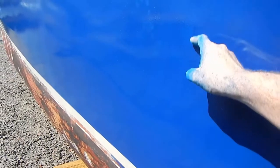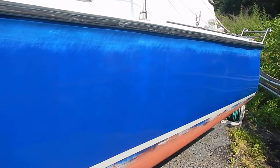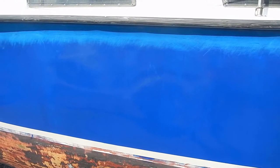But a couple other reasons — I'll show you why I have to sand this whole thing down probably every time between coats. One reason is roller marks. Some of this is probably correctable by better technique when rolling the paint, but I think it's kind of unavoidable at the end of the day when you're not spraying a boat and you're just rolling the paint on with a foam roller. I need to sand that out so we don't end up with any pronounced ridges in the final paint job. Second reason is the foam separated from the hard plastic hub of the roller, and I ended up with all these little raised speckles — I need to sand those little bumps off.